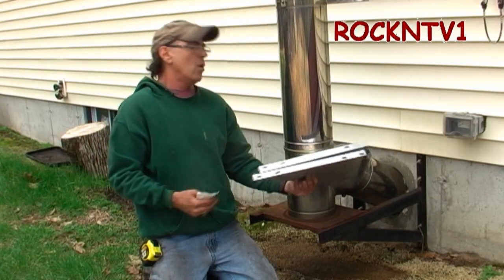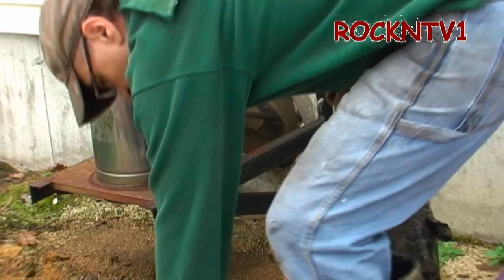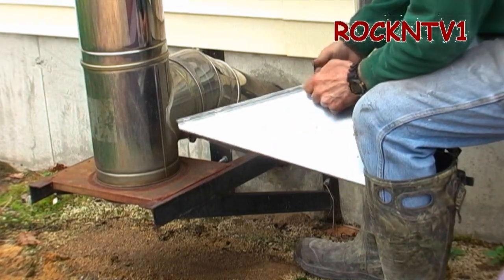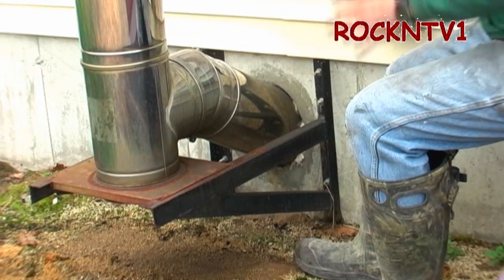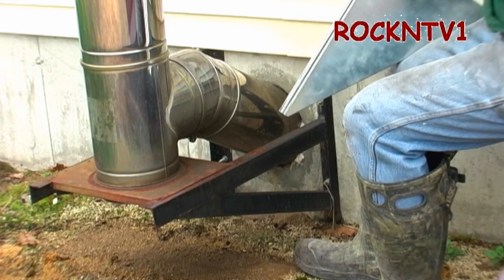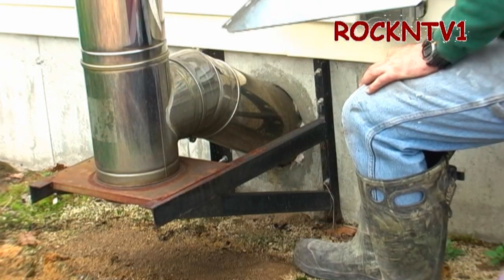The way I wanted to make this was so that it did not kink around my overhang. As you can see in the photo, these are triangular and they have all the holes on the top for the base plate and the T-pipe. Selkirk says on the outside install — which is what this is — you can theoretically run this through the center of your house and up through the floors and roof, or out through the wall. That's why they call it the through-the-wall kit. You buy the kit, you get the elbow and the angles, which are 30-degree angles.